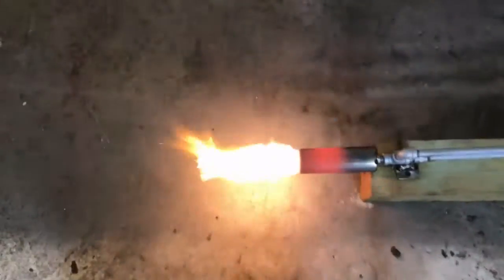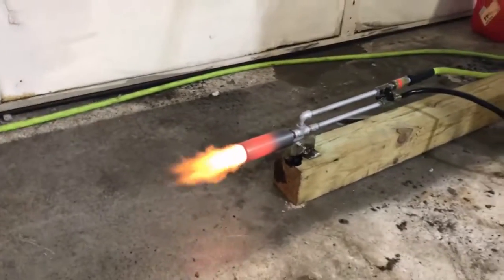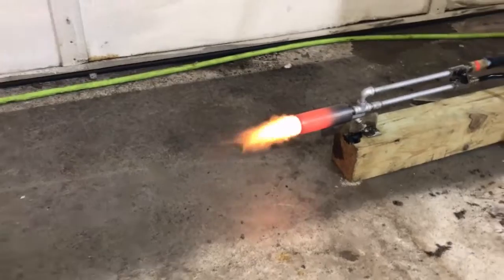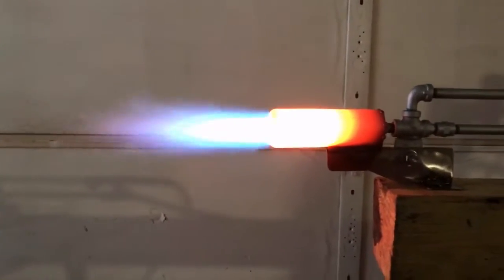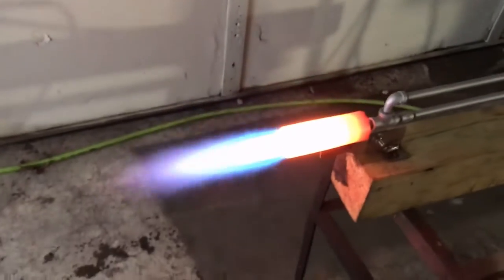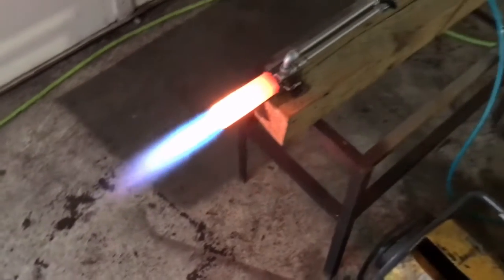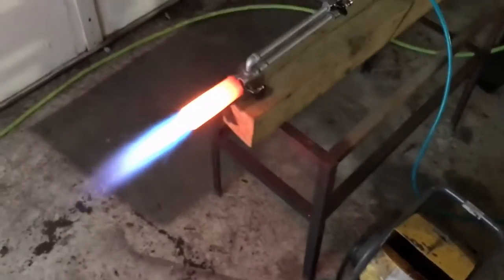For the purpose of contrast, let's examine an air compressor powered burner. The throttle adjustment works across the total spectrum — we can turn this thing down to extremely low operating rates and we're still able to burn all the fuel; we're not spraying fuel everywhere. This is waste oil in this particular clip based on the color of the flame. We're not even splattering waste oil all over the floor. Here we see a tiny little air compressor burner outperforming that blower burner big time, blowing it out of the water. This is going to be completely self-cleaning — absolutely no buildup in a combustion chamber like this — and we're only using about a thousand watts of power to run the compressor.